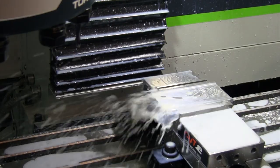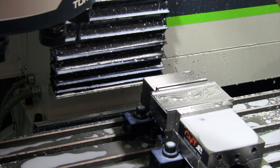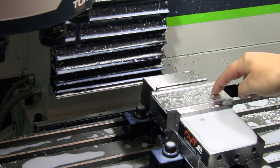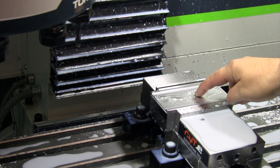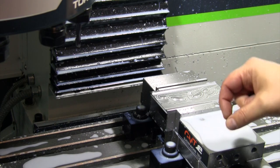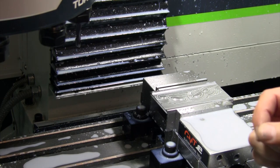This time I got the break, I got the pause, but I restarted at the beginning instead of after the first cut. Got it right third time. All right, well, famous last words, I think I've got it. It's still an M01 pause, so I had to turn on the M01 cycle break to make it stop after that. It didn't stop the spindle after the first one. It did stop the spindle after the second one, so not quite sure of the difference, but I was able to hit stop, and then I told it where to restart on that line of code and got it to kick off again. So I think I should be set.